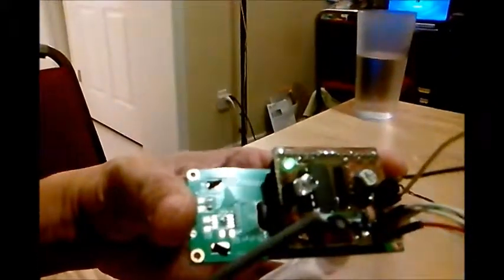You can see that black thing there — that's the sensor encapsulated with silicon into a tube. At the back you can see the connections. I use a 16F688 microcontroller here. This LED — when the AC is on, that light will turn on. It actually drives a relay, a solid-state relay, to drive a higher load.